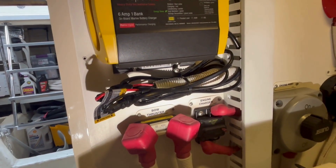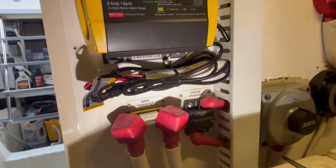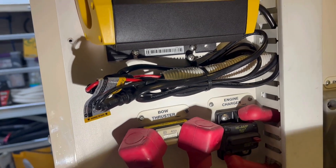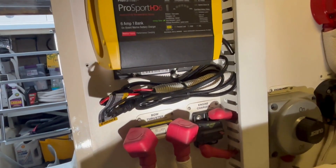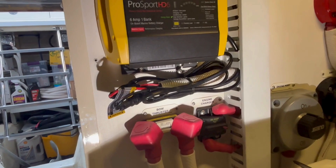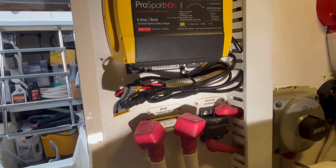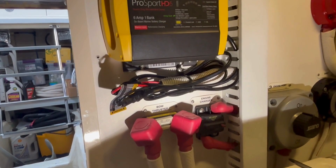The last step was using a cable tie screwed down to securely fasten all the cables so they don't bounce around when we're in heavy waves. I did have to leave it looking a little sloppy — I had to leave the new fuse protectors accessible so they're easy to get at in case I ever need them, although I've never had an issue. The video makes it look a little easier than it was, just because of the tight area I had to work in. Soldering was probably the toughest part — I could have used a slightly hotter iron for that thicker wire.